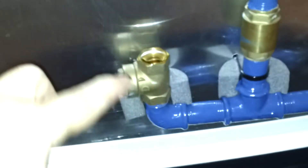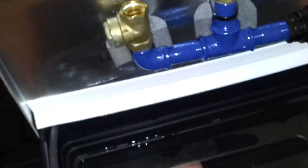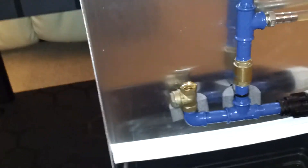Because water flows through the pump, there's always water coming out of this valve here. For the demo rig it's collected in this tray, and we've got a suction pipe here and a small electric motor around the back powered by a battery just to recirculate the water — it tops up the supply tank. Otherwise we'd be losing water and would have to continuously top up the supply tank, but this way we keep a closed system and all the water is recirculated.